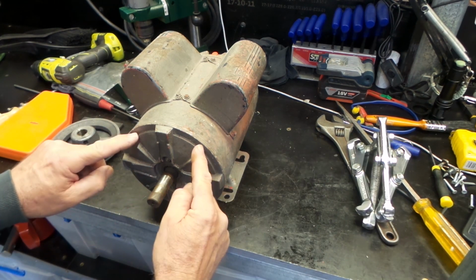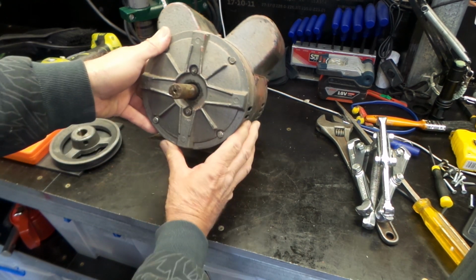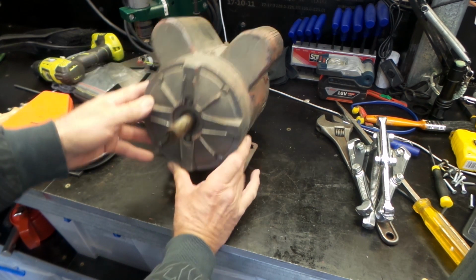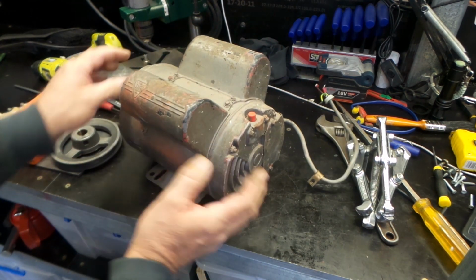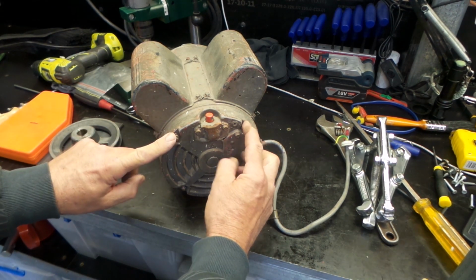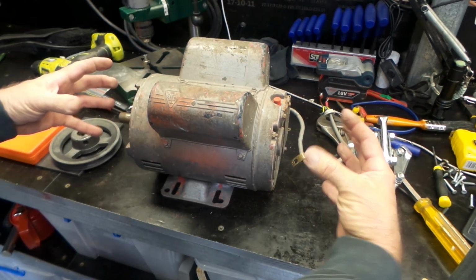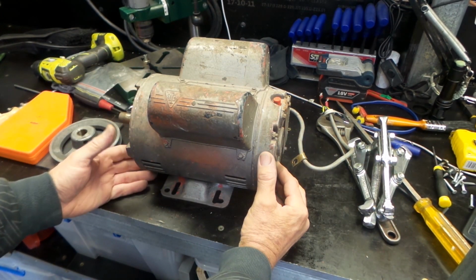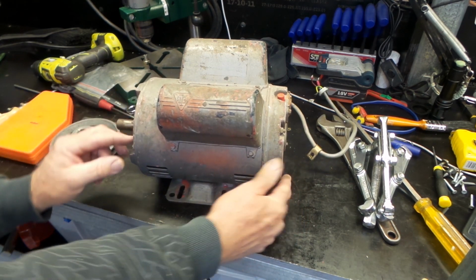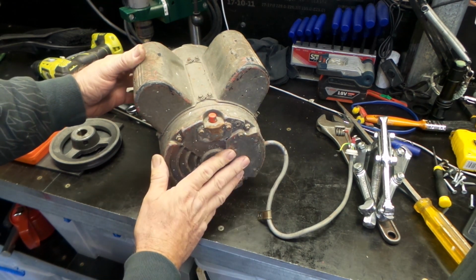These bolts on the casing, you can see there's 4 of them here. They generally go right through the motor. They'll be big long fellas, and that'll be them there on the other end. 1, 2, 3, 4. We'll undo those, then we should be able to just get the casing apart like so, and get to the shaft in the middle, slide it out, have a look at the bearings. So I'll grab a little socket and we'll get into it.